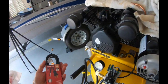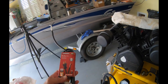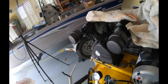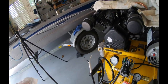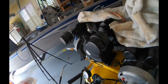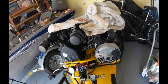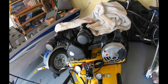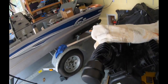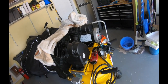The cord I'm using on this is something I bought at Home Depot - it's called a Husky tool replacement cord. What's nice about it is it only brings two wires, which is good because the switch I'm going to put in there only runs with a positive and negative wire - it does not have a ground. All it's doing is reading the electrical current when this compressor is running and doing a clock countdown on it.